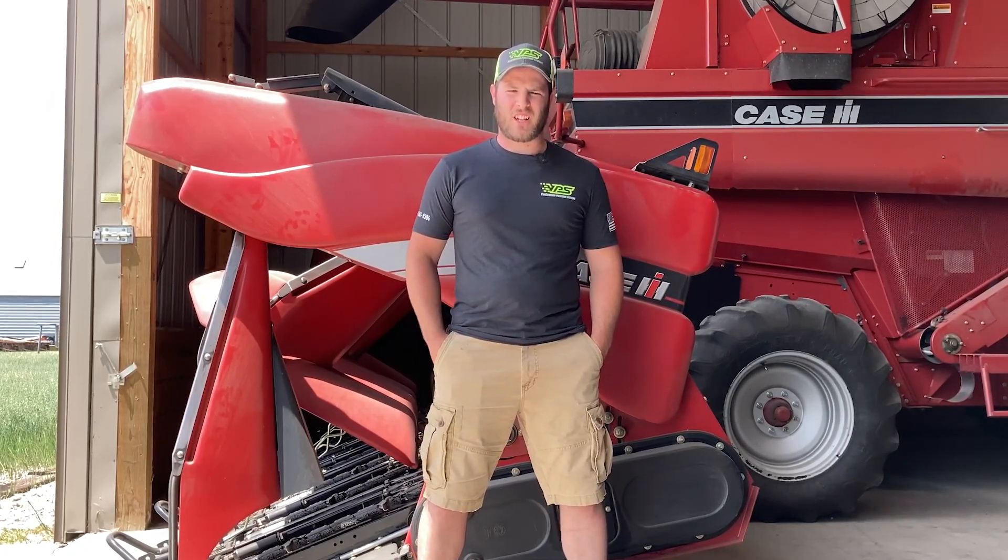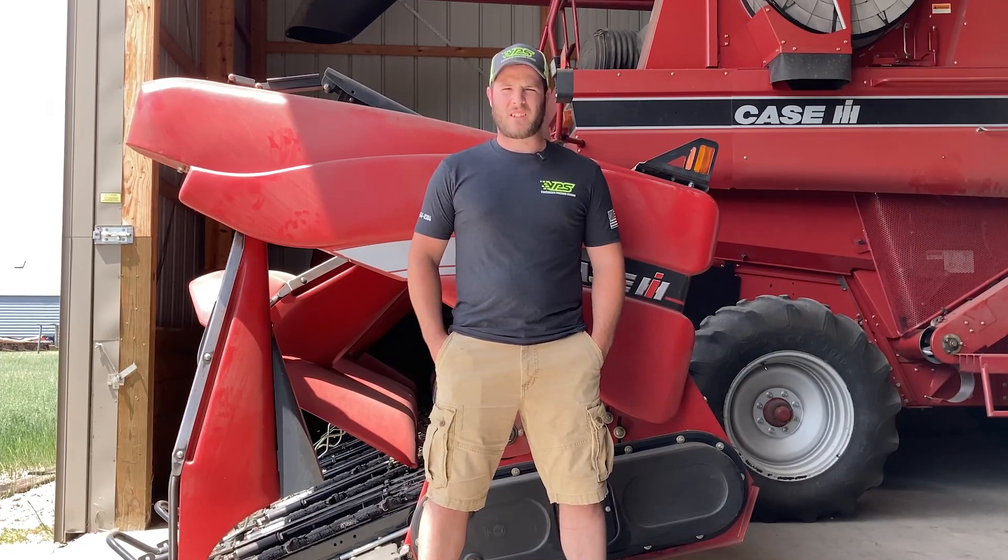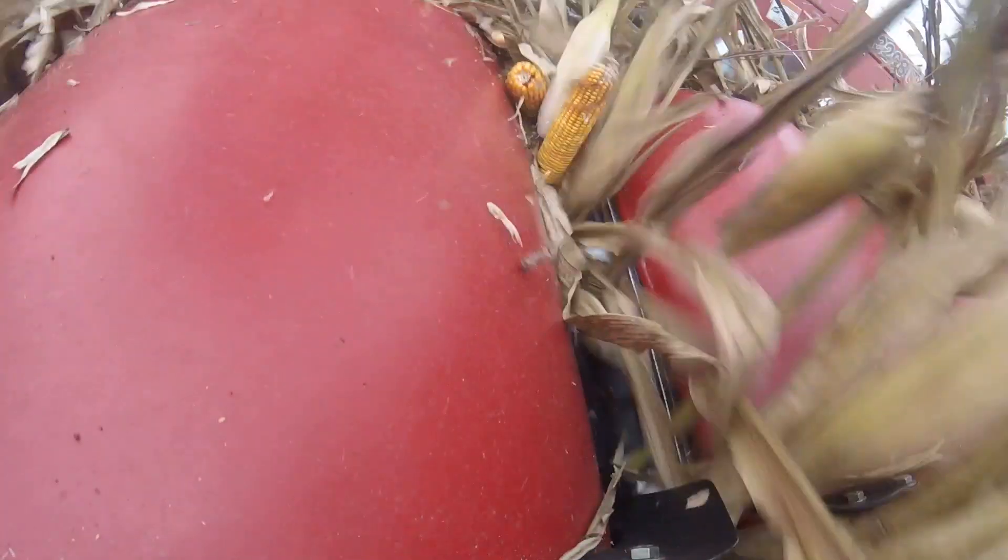Bringing the ears into the head, you've got that chain with the brushes on it and it cushions them — you're not going against a hard steel deck plate and watching the bottom of those ears just explode. You've got something to cushion and catch that. You minimize the amount of butt shelling up front, and anything that does butt shell you're sweeping in with the brushes — it's the best of both worlds. As those brushes wear, it's not necessarily a huge concern because they're still cushioning that ear and still eliminating the butt shelling.